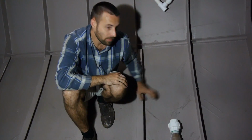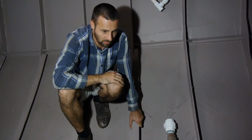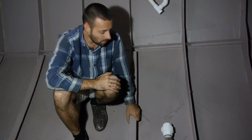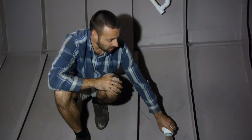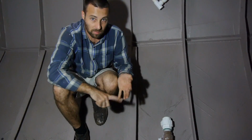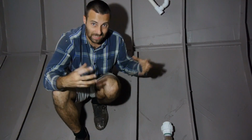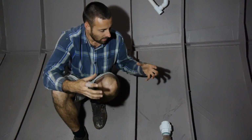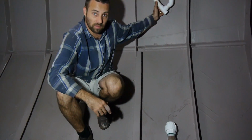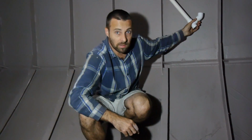We've used this system for years on boats. We've been through 50 knot blows, 60 knot wind, I think a separate 60 knot storm. This was in a little yacht, so a lot of twisting happened. And the most reliable piece of the system was always the pipe work. If anything's going to fail, it'll be macerator pumps, deck fittings, toilets. It's all of the things at the ends of the pipes, holding tanks particularly, as opposed to the pipes themselves. This pipe work is incredibly rigid, but at the same time it's very strong. It can take a lot of vibration and a lot of flexing.